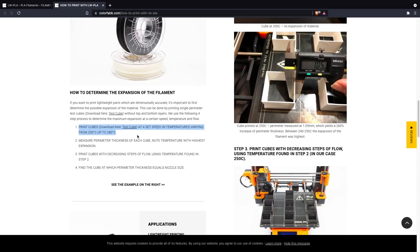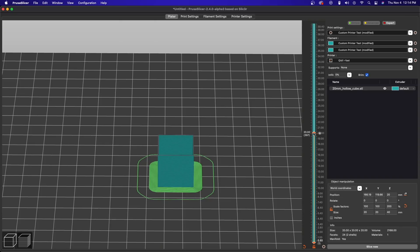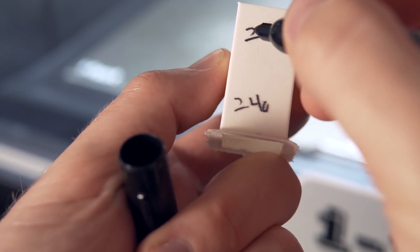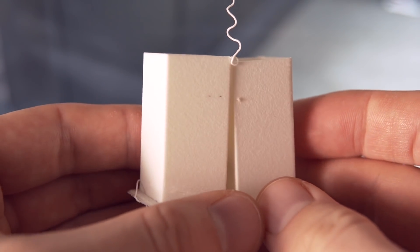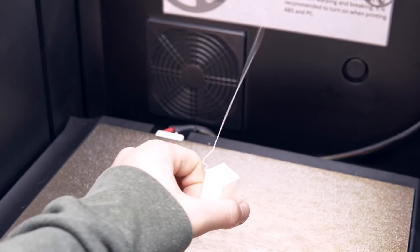As far as slicing and calibrating this material, the process is fairly similar to the instructions for the Lightweight PLA, which I'll link in the description. The first step is printing the filament across a wide range of temperatures — the foaming properties are triggered by printing temperature, and while the foaming amount is consistent at a given temperature, you'll want to find the sweet spot for your application. The foaming for Lightweight ASA starts at around 230–235°C, so I printed single-walled cubes three times and entered a custom G-code line at the halfway point to increase extruder temperature by 10°C, ending up with half-cubes printed at 240, 250, 260, 270, 280, and 290°C.